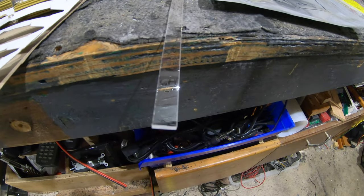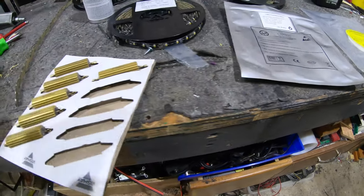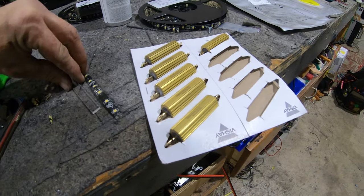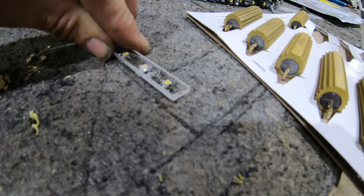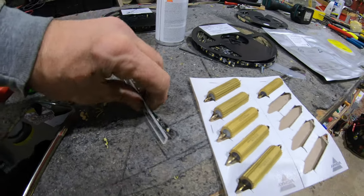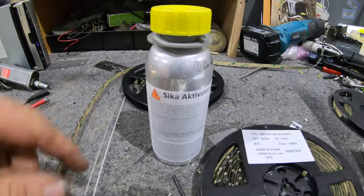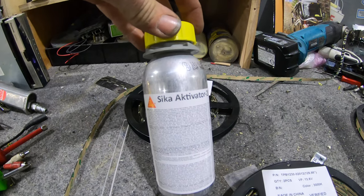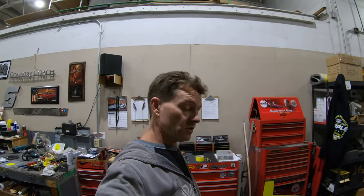Here's that piece of clear plexiglass I was talking about. Sometimes those window boxes have a channel — with the extra void in there, you put the light in and then put that plexiglass in there, which is 3/16. I have those ripped over at Multi Craft Plastics, one of the local suppliers. Here's that activator I put down before I stick the lights down. I think that's going to cover everything.